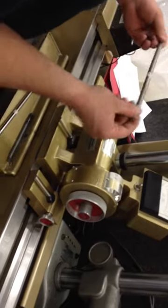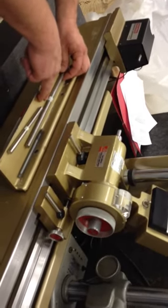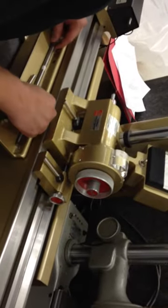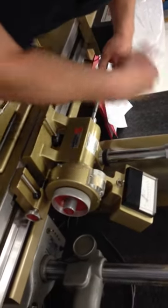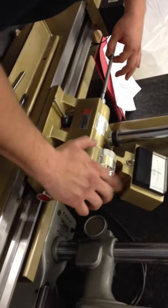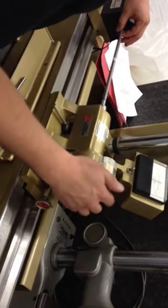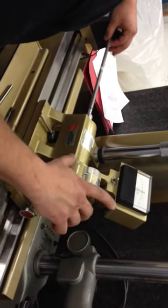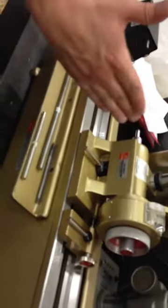over on this rod. But if we have a known size right here, you can technically take that size and zero out this machine, which means you could put this in here. It's going to be real hard to get those up, the things that keep it up in the air. That makes it a little easier. You could technically go like this. Set this at zero. Find your highest point, which is there. Just like that, and then you can move this down to meet your zero. And then you could use this machine to a more accurate spot. You run that thing down right to there. Now you got your 20 millionths accuracy back because you use this as a known size standard.